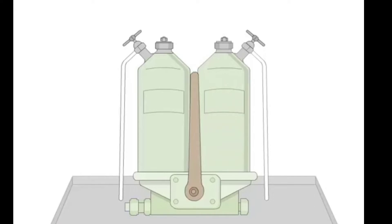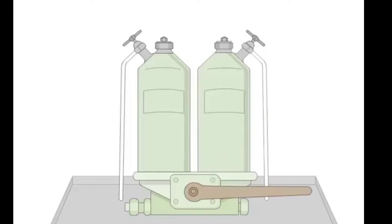If the filter elements are clogged, blow-off is not effective. When blow-off is not effective, we have to clean the filter element when it is not in operation. First, we use the lever to isolate one side of the filter, and open the purge cock to ensure that the oil is flowing through the filter — this confirms whether oil is flowing or not.